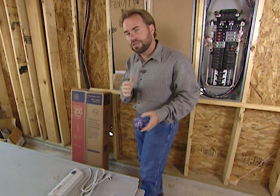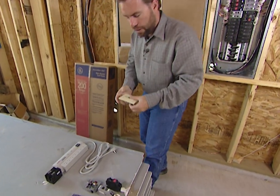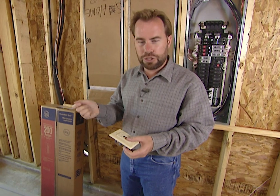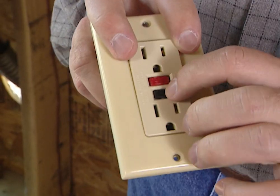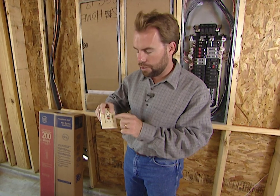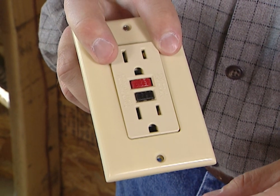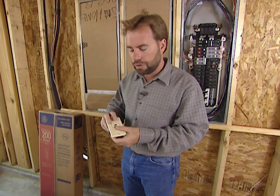That's great to have, but it doesn't solve the other three problems we were talking about. One is ground fault — if you drop a hair dryer or a radio into something wet, or you're in the garage spraying with the hose and hit something with power, you need it to shut off immediately. You've probably seen these GFCI outlets in the wet areas of your house — bathrooms, kitchens, and garages. They have a test button and a reset button. If you ever lose power on outlets in those areas, just flip the reset button and see if it works.